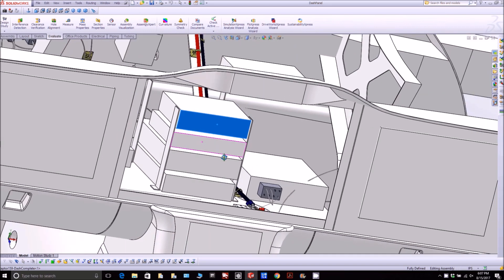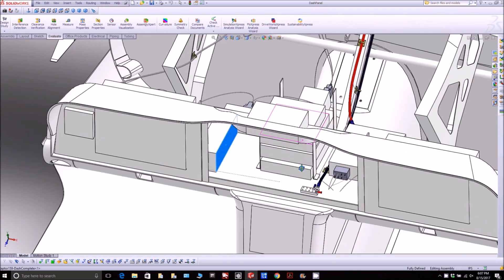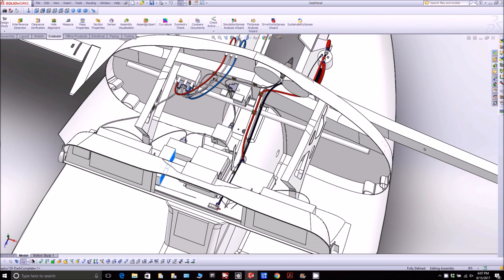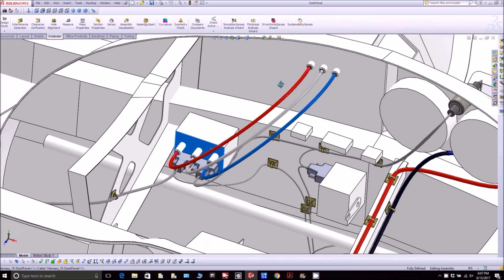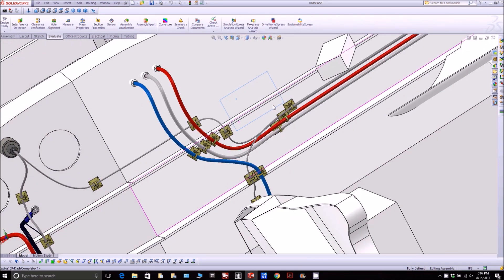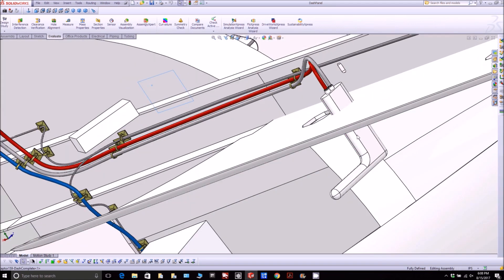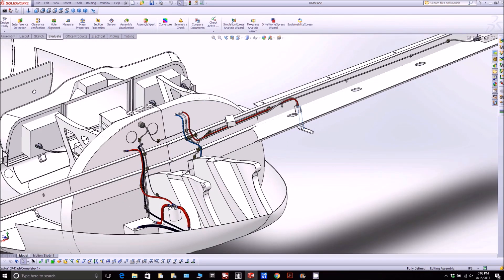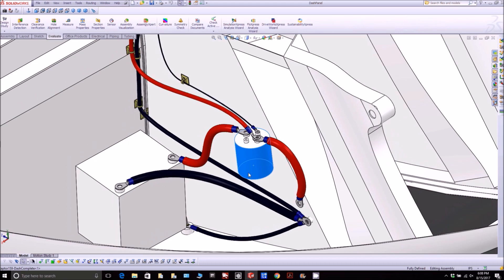Back in SolidWorks, you can see I've kind of stacked a bunch of these units — that makes life easier. I've got the backup battery over there. I moved the vertical power over to the right-hand side of the tray. You can see I've got the pitot-static system in here — pitot-static and the airway tubes are in there. I moved the GSU 25 over to the other side, and all of this runs down to the pitot tube that I mocked in place, so it's coming along.